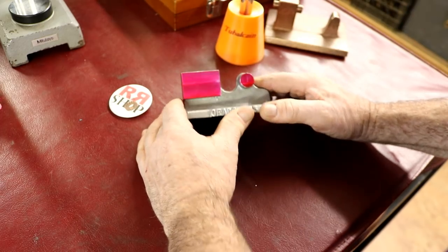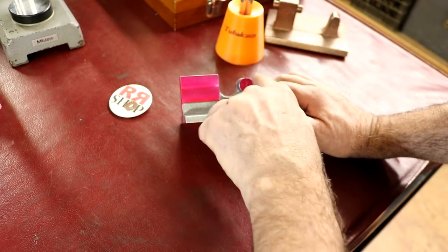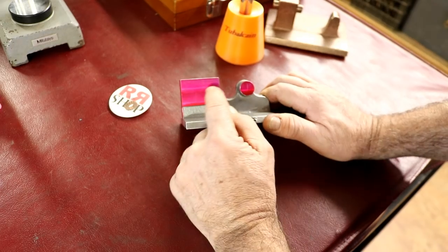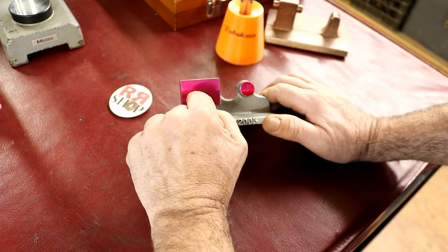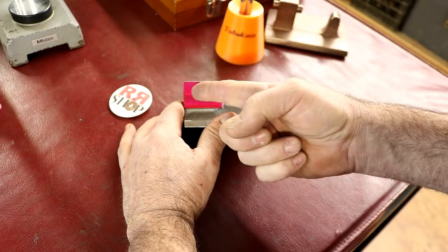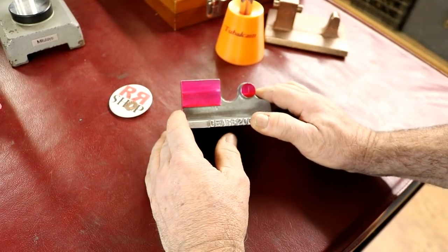And in doing that, that led to changing a couple of dimensions on the cylinder itself. Because of the stroke, I was able to keep the stroke the same, actually. But by changing just a little bit of the dimension on the cylinder, I could make this all work a little better. I changed the length of the connecting rod a tiny bit to get a good, full effective stroke, and I also adjusted the porting to line up a little better. Not the spacing of where the ports are, I left that the same, just the angle of the port in the cylinder. They had 30 degrees on the cylinder, and I made it 28 degrees. If you see the previous video, you'll see I was using 28 degrees, and that's why.